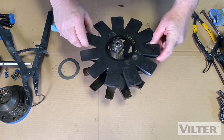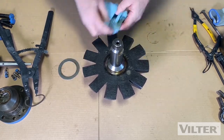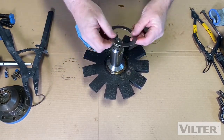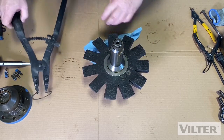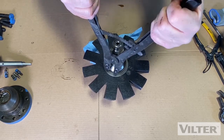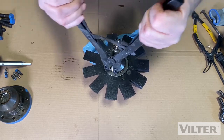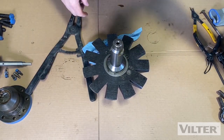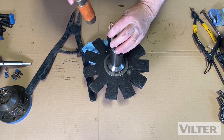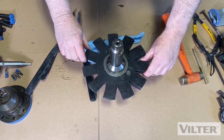This tells us the story of the compressor itself. We could put a new bushing in if we want, but remember when we took the measurements everything was good on this one. I'm going to put this back on — I'll take a little punch and give a little tap around, and it snaps right into the groove, which will hold the blade in place.